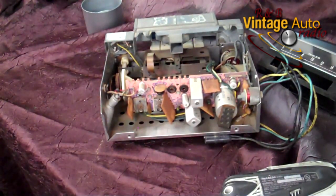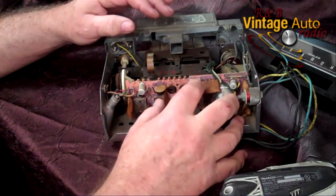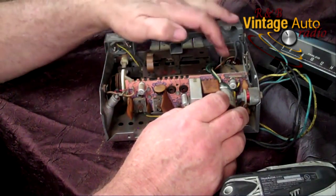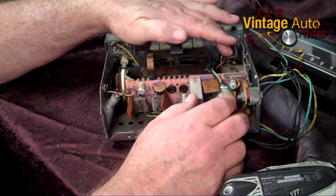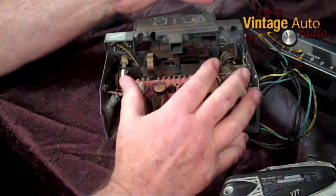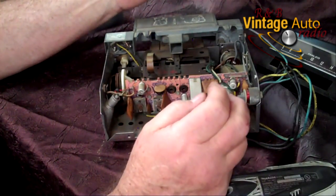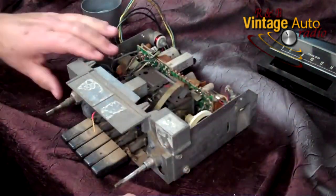What we're going to do is a conversion on it. We're going to take out all this right here, which is actually the tuner and everything. We're going to keep the original tuner, original tuner coils, keep all this original case and all. This is your off and on volume tone switch. We're going to go through it, clean it up, make sure it's working, take all this out, and put the Aurora design conversion parts in it. We're going to add some RCAs to it for pre-outs - it will have four channels out, 45 watts a channel, and become a useful radio again.